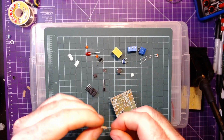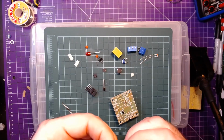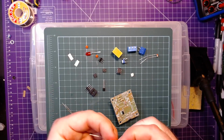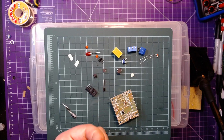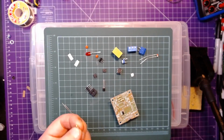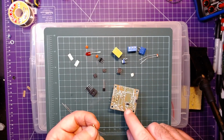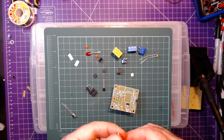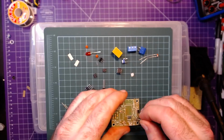So what resistor do we have now? Are we still in focus? Yeah, ish. I left everything auto, so hopefully it doesn't screw me. Alright, so you know how I told you they have weird colors you don't see often? So this one has 2 weird colors. Yellow, purple, and red. So it's something something, and then 2 zeros. I see there's 4.7, so yellow must be 4, purple must be 7, and then 2 zeros, 4.7K. That's exactly what we have there, which is nice.